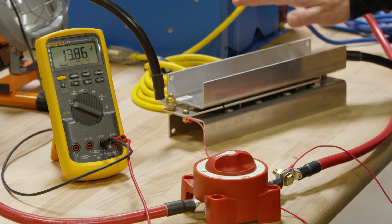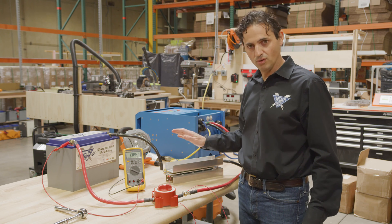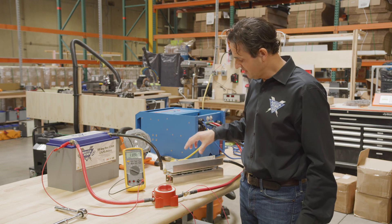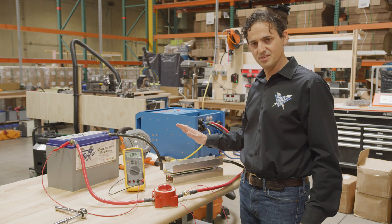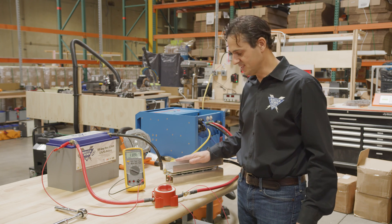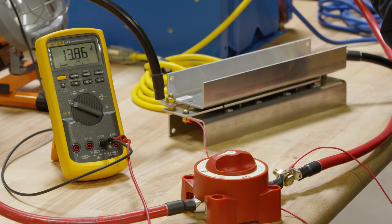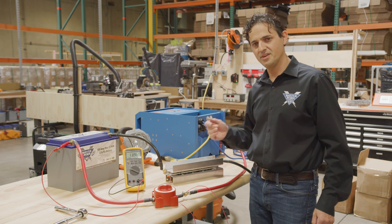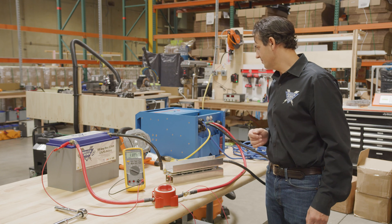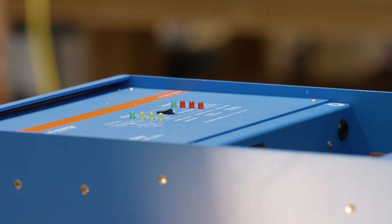Now it's fully connected. The voltage on the capacitors is full — basically at 13 volts — so the CSL takes itself out of the system. We are no longer limiting current with the CSL, because the voltage on the sensor wire now reads 13.86 volts. So now we can turn on the inverter, and it immediately starts inverting and delivering power.